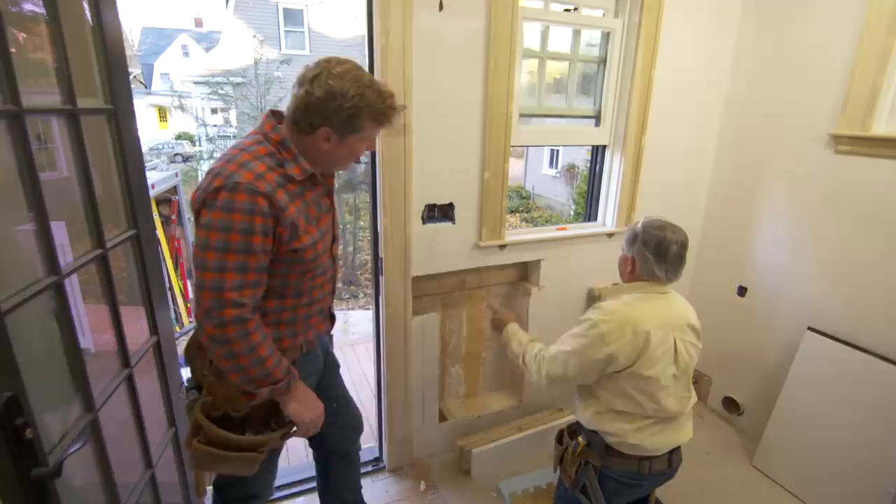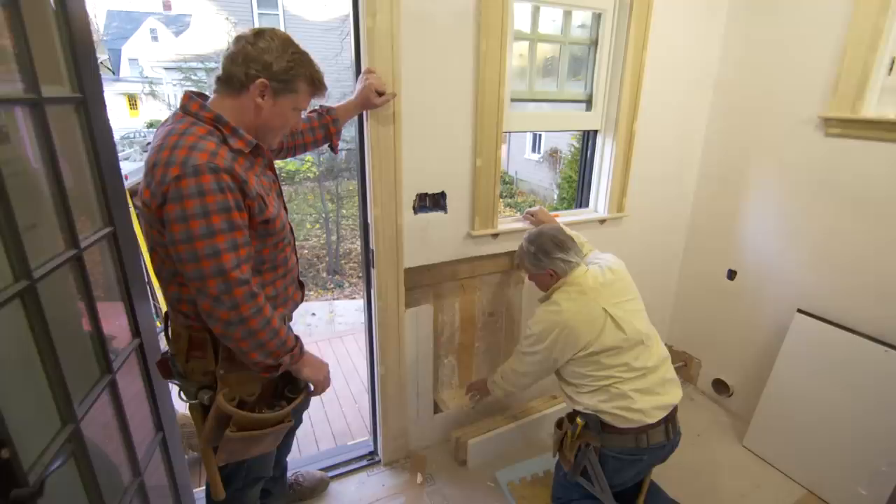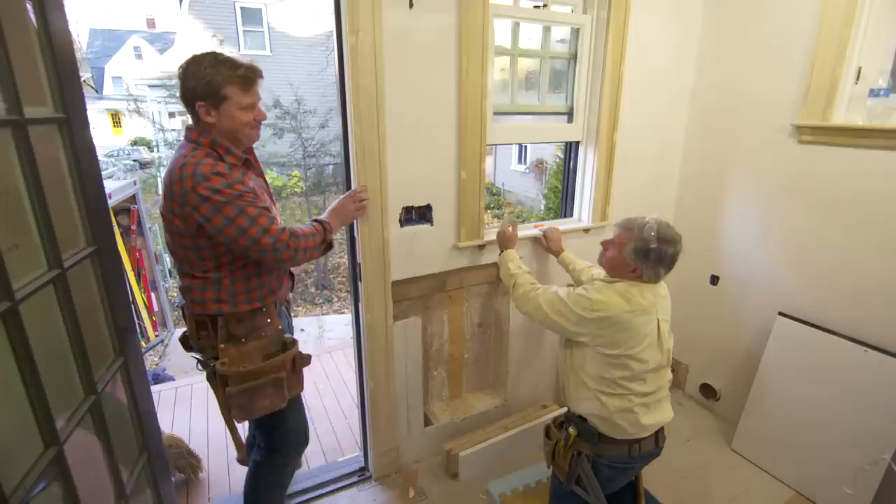How do you mean? Well, it would have been perfect if I could have put the dog door right under this window. But because of where it is, I had to cut all the structure down here — four two-by-sixes carrying that header up there. If you go outside and look under the window, we have a stairway, so the dog would fall down the stairs. I have to move it all the way over here.